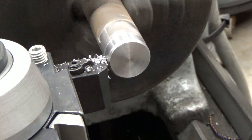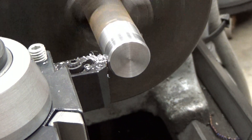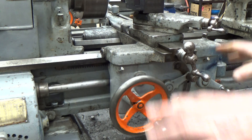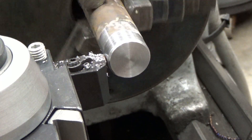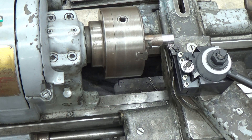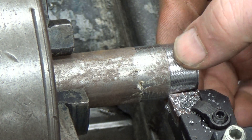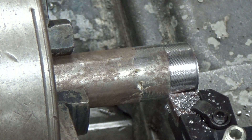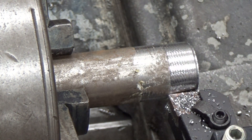I'll stop at mid-operation to show you the results and compare my hand feed versus this 10 thousandths per revolution. To disengage, I just take this knob and loosen it up, and now we're no longer traveling. I'm getting a little bit of surface chatter — it's a very nice clean surface, but I can see some chattering effects. I had mentioned that we want to chuck our material up as close to the chuck as possible. The further it sticks out, the more opportunity it has to vibrate, and I think that's what's happening here, so I'm going to adjust this and bring it back further in the chuck.